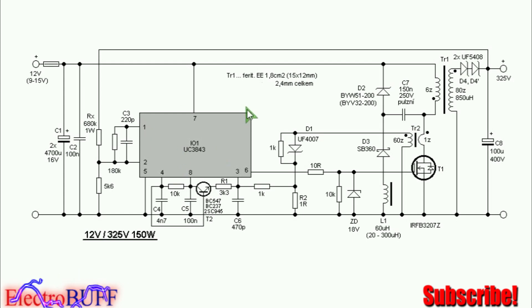The complete circuit schematics are as shown. You need a power supply, preferably 12V, but any from 10 to 15V will work fine. Then you need two input capacitors, C1 and C2, which eliminate any high frequency noise. The frequency of the IC is determined by this resistor and this capacitor. In the values shown, the frequency is about 50kHz, which is designed for high frequency switch mode power supplies.